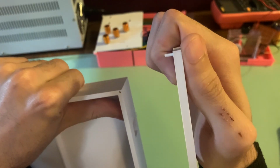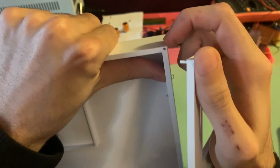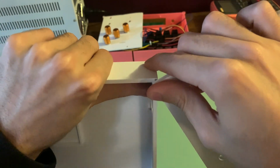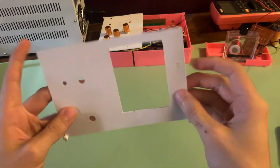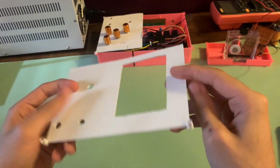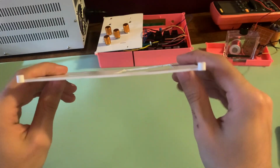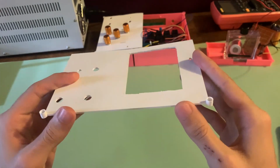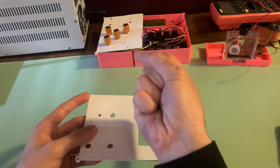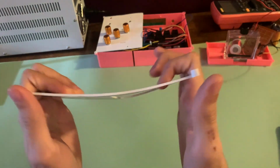Take for example this dowel here, which measures about 0.5 millimeter in diameter, smaller than this hole. So in theory it should be able to fit, but it's just a little bit too large. Another issue I ran into was bowing and deformation, which would occur during the 3D printing process. You could see this part right here is noticeably warped. And this occurs because as the plastic from the 3D printer begins to cool, it begins to solidify and compress, causing the board to bend in on itself.